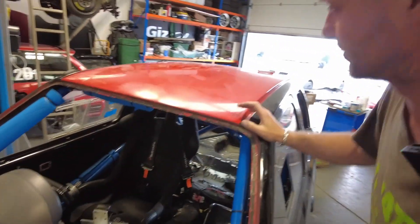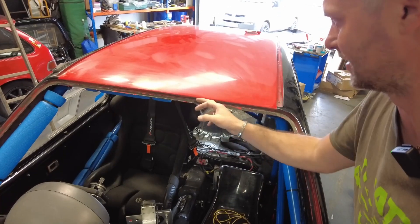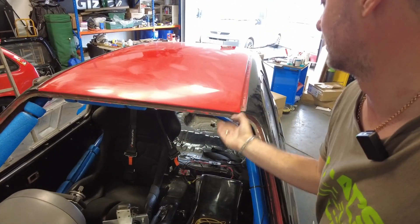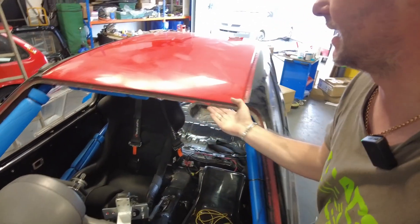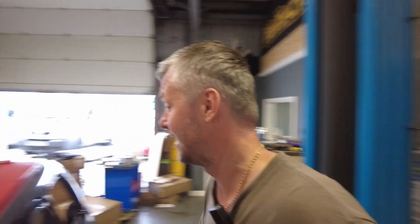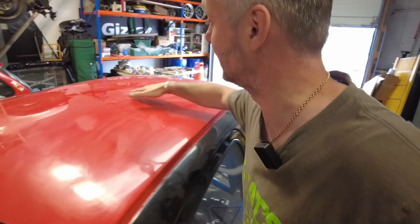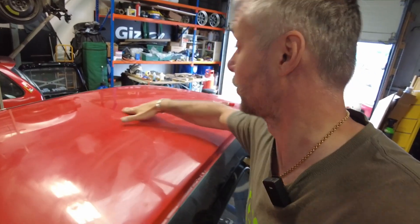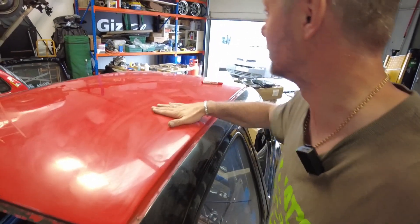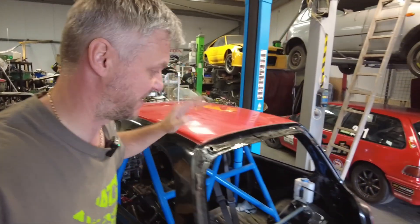For the front, again super simple — just a simple U-shaped flange. We're gonna put some cardboard in here to prevent resin from dripping on the lovely spartan interior of this wonderful KissFab micro. Again, going to use PVA because the surface is not very even, and chemical release agent is good for molds, but in this instance PVA just does wonders.